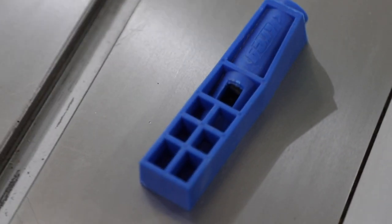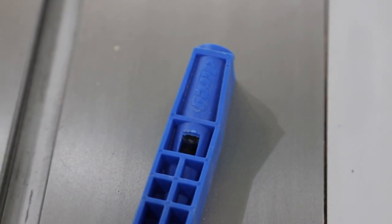What it does is it helps you to join two pieces of wood very, very easily. It takes a lot of the thinking out of it. You just can't get any easier than that. So let's talk a little bit about each one of these before we begin. Let's talk about the single hole. With the single hole, it actually comes with something that helps you to kind of set it up and put it where it belongs. It's a little bit more difficult to use than the other ones, simply because it doesn't have all the automatic stuff on it that the other ones have. But it's also like 20 bucks or something like that. I don't even know. You clamp on the back end, you put your wood underneath, clamp it there, and drill right in there, and it gives you a nice clean pocket hole that you can use to join it.